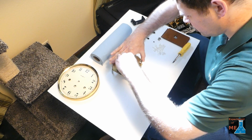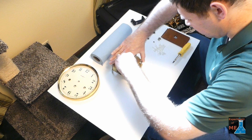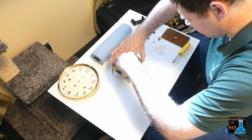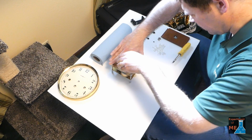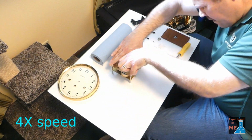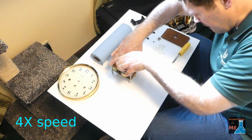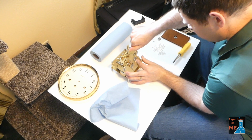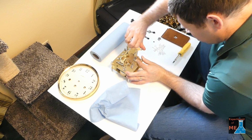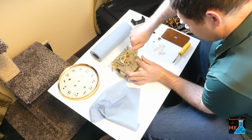And right here I am unwinding the springs. There's a lot of tension in those springs, and so the first thing to do is to remove that tension, because I don't want it to destroy the clock mechanism. If I were to pop out a rod without releasing the tension, that'd be really bad. And I don't want one of those things exploding and shredding me, because it's a really tight wound spring.